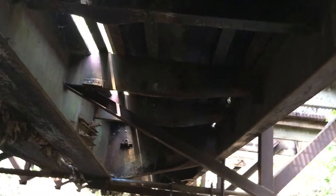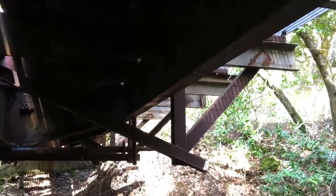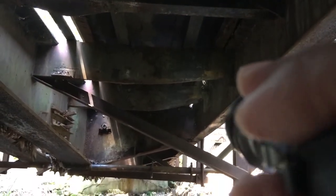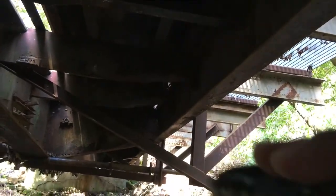From an inspection standpoint, you can see that this crossmember here — let me get my flashlight out — that crossmember there looks really good, it's straight all the way across. But wait, look right there — it's damaged there, so that's a problem. And if you look at that crossmember over there, it looks damaged too. The next one's damaged as well. So this car does have some damage — it should have been repaired before they installed it. They did some interesting engineering work with these kickers and angles, but then they don't spend the time to fix the damage.